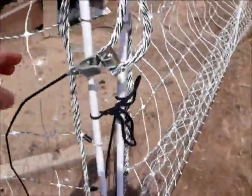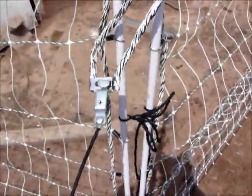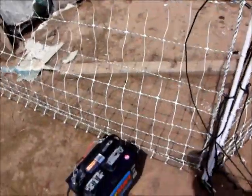There's actually no ground hook to the fence itself — the fence is charged with a positive wire. You can see here I just clipped it on to the fence. I don't have to have the ends of the fence connected because it grounds through the soil and comes back to this ground rod.